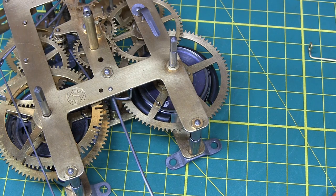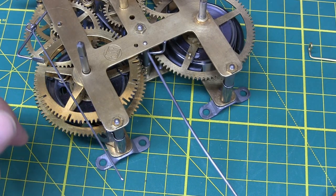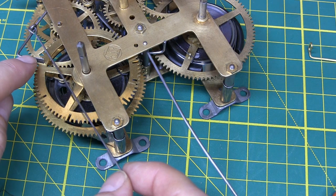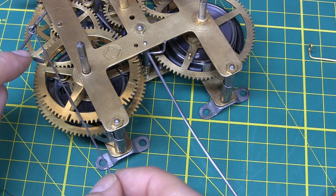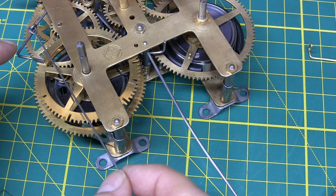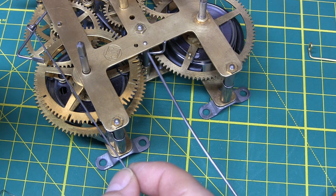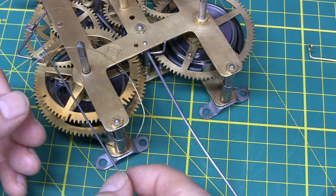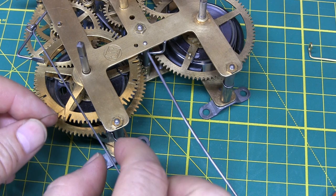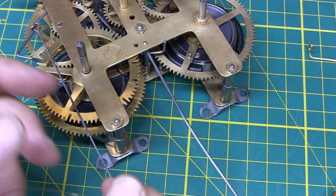I'm going to make a little wire. I lost the little wire that connects to this post and goes here to keep this from interfering — you don't want this hitting the count lever wheel. It should not be hitting that, so bring it in enough so this can freely go up and down without the wire slowing it down at all. I'm just going to have it come in about like this. I'll just make a loop — I have this piece of 25-gauge brass wire. I'm going to make a loop around the post and then braid it, then connect it here. Maybe a stiffer wire would be better, but we'll try it.